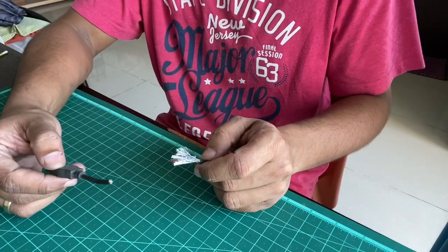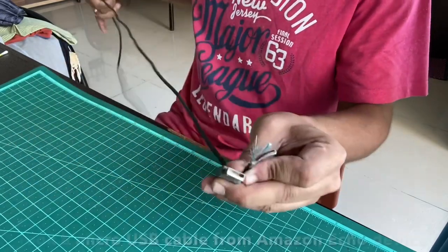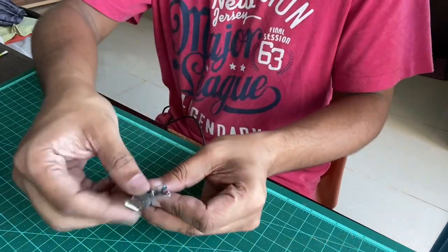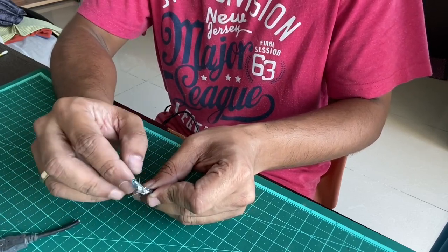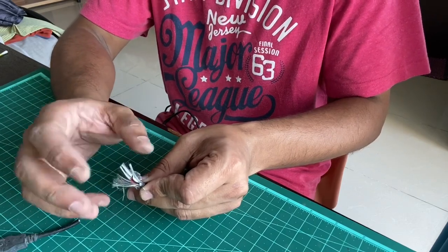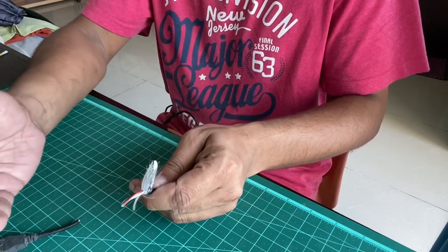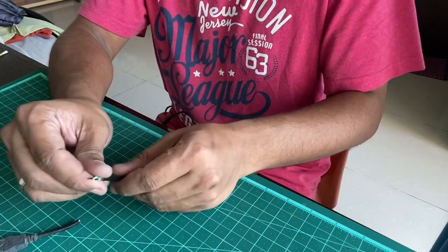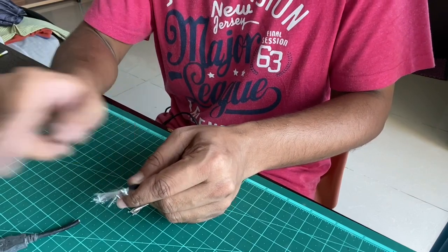You're going to need a shielded USB cable for connecting the extension. What I did was take a micro USB cable - one side is a normal USB, the other side is a micro USB. I simply cut off the male portion. You can see the shielding here - this is required because otherwise the unit may have difficulties connecting with smartphones and other devices. Get a USB cable, cut off the male portion, expose the cables, strip the insulation off, and then we'll solder it.